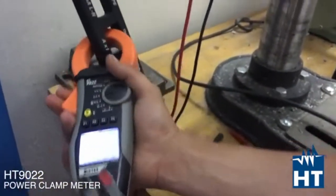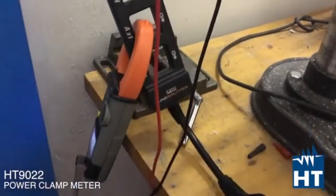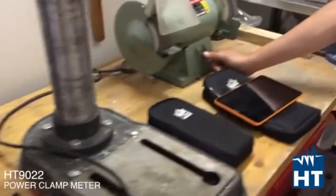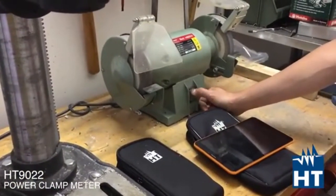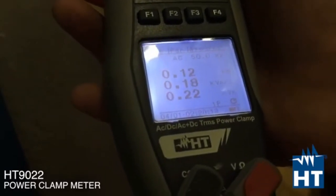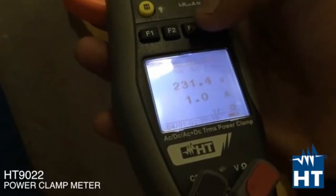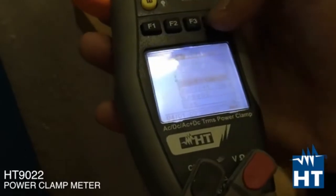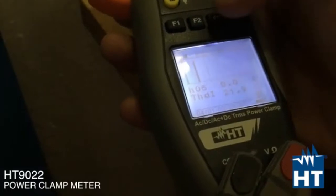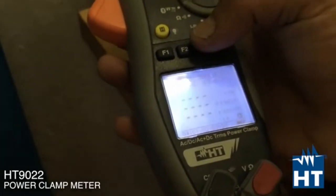Clamp at the 10x multiplier. Now we are going to plug in the motor and record all the parameters. You immediately see the value of active, reactive and apparent power. You can also see more parameters, for example the voltage and the current, the voltage harmonics, the current harmonics, and even energy — because this instrument can record for a longer period of time so you can calculate energy.